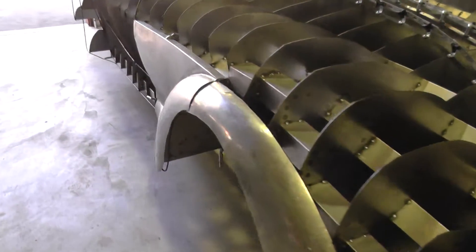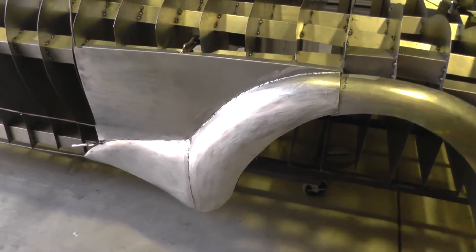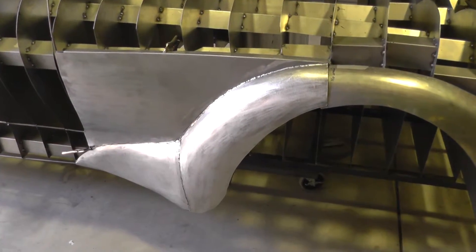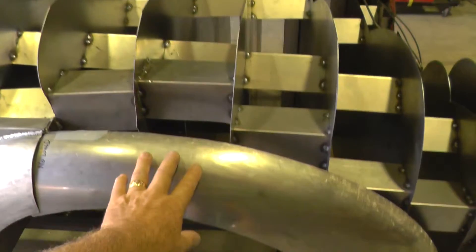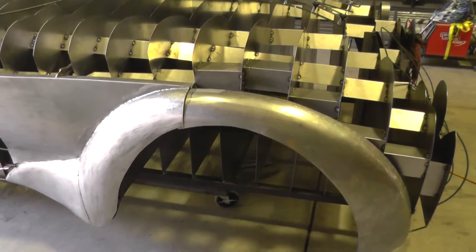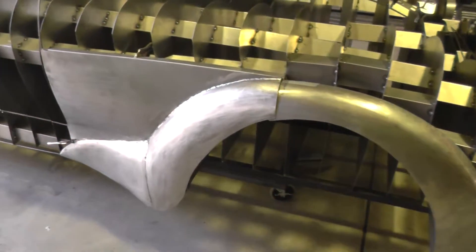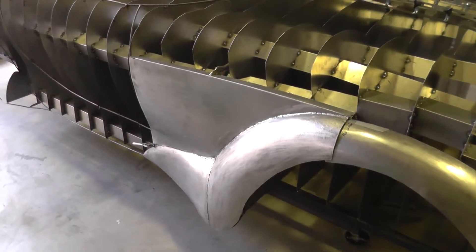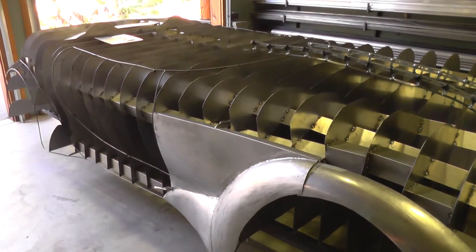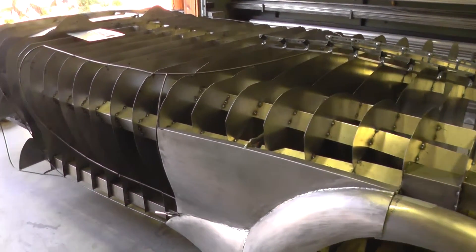On the other side of the car I've got that same setup — pretty much the two rear flares and that one quarter panel have been put together and attached with the welder. This other piece right here will actually be welded onto the hood section, so there will be a seam between those two. I'll create a small 90-degree flange where the mating surfaces come together. For the most part, it's just a step and repeat — there's just a whole lot of panels on this project, and what I've gone through is the process that will get me there.